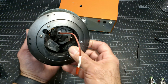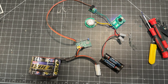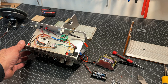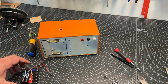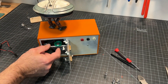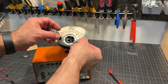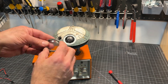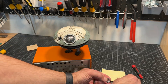The lower saucer slides over the feet and four screws attach it to the upper saucer. I decided to add sound to the droid — I ended up removing the soundboard from a Lola toy and connecting it to the Maestro. The sound system, batteries, and second Maestro are mounted into a box. I will show how I made this box in another video. The box has an access panel in the back. The droid's feet posts slip into the pre-drilled holes and a clamp secures the droid to the box. The power cord from the droid connects to the wire inside the box. The last thing to do is install the eye parts and lenses. I use butyl tape for the main eye and lens, because if I need to take the droid apart I will need to access the tilt set screw. The small lens is glued in.